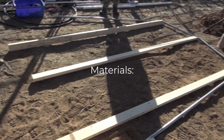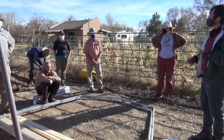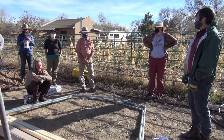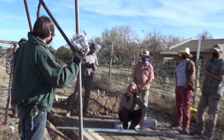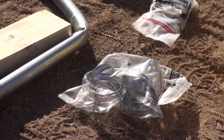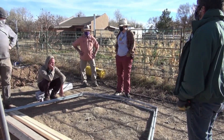In terms of materials, this is just a standard 21-foot length of 1¾-inch fence pipe. For the covering, ideally we would be using some reused materials — it could be lumber tarping; a lot of hardware stores throw that stuff away. We've got our stainless steel adjustable clamps which can go under the hip joints, really cinch things into place. Let's lay out the general structure and then put some pieces together.